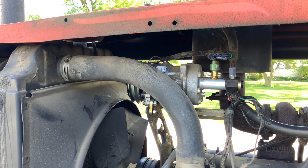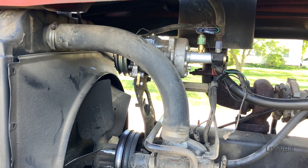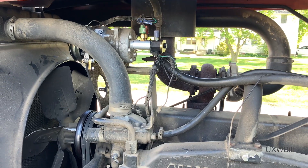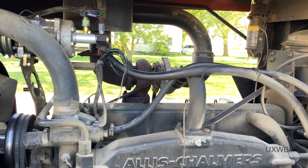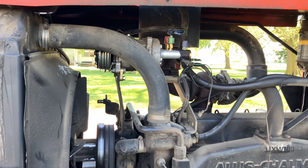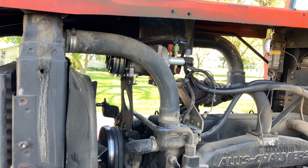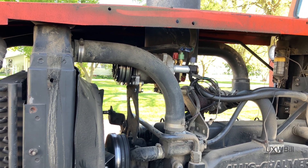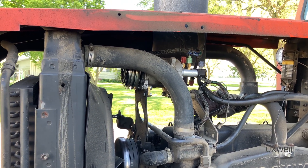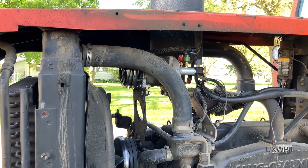You'll have to see where we're going to go from here. I'm going to talk to AP Air about it and the people that supplied the compressor. At a minimum: new compressor, new TXV, new high-side valve. I don't know if the TXV could have factored into this or not. Those of you who watched the original series of videos probably remember that when I ran nitrogen through the system, it took several minutes for it to flow through that TXV, almost like it was just slammed completely shut.